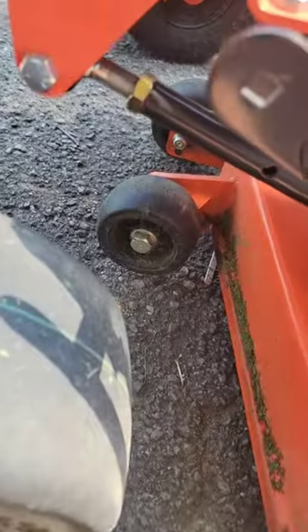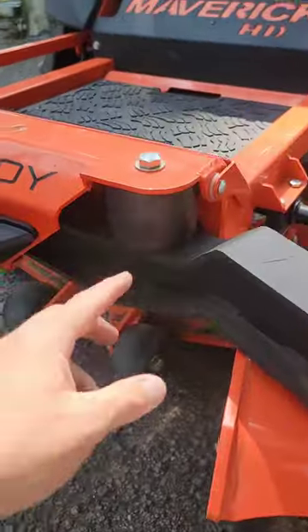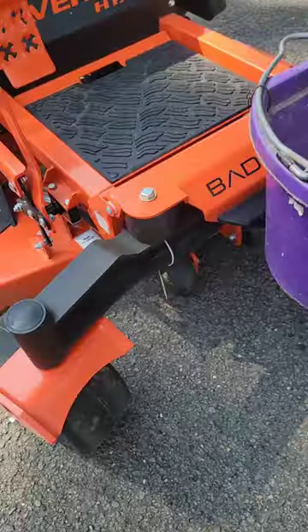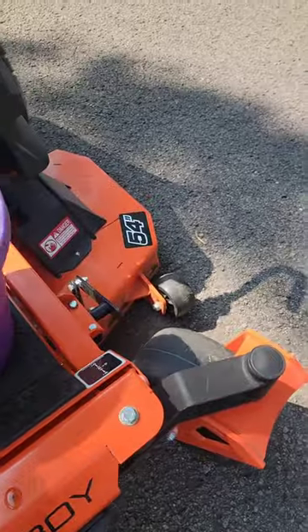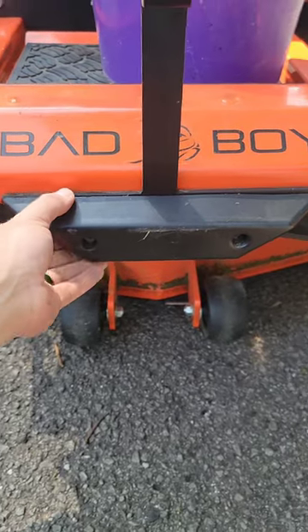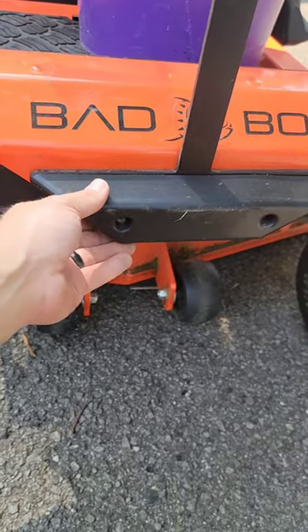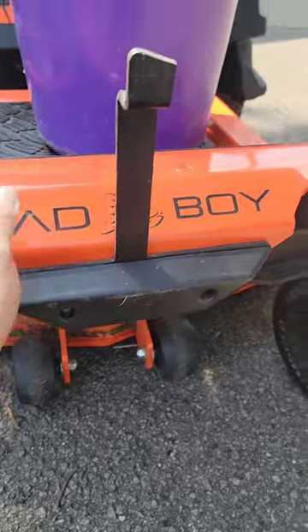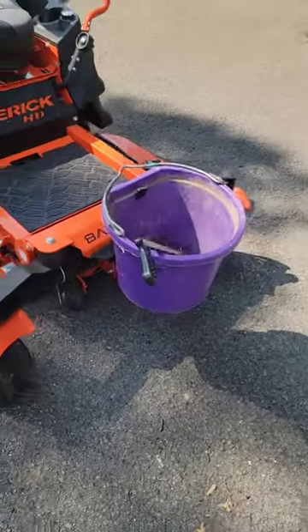The casters are well-made and reinforced. The front tires are no-flats, so you don't have to worry about briars and thorns. It's got rubber pads in the front and a really stout front cross member — kind of a W-section design. I also made a custom bucket holder: I traced out a piece of plate, welded a bracket with a little Z to go inside the bucket, and attached it back through the same bumper holes. It's sleek, removable, and doesn't stick up as high as the Bad Boy branded bucket holder.